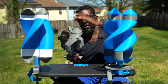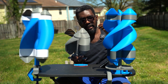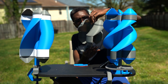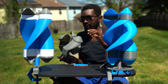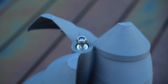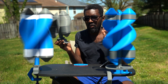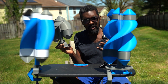The reason the first and second ones were not spinning was because I had the wrong nut at the top. The nut would tighten and clamp down on the vertical axis wind turbine and seize it up. To fix this, I used a locking nut which keeps its distance from the top. Also, I did not have washers at the bottom — without washers you get plastic on plastic friction and it won't spin as well.